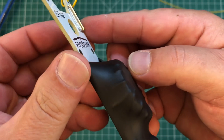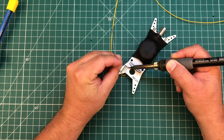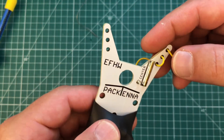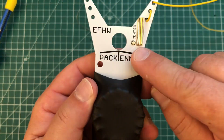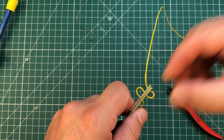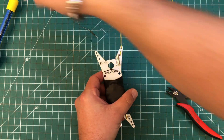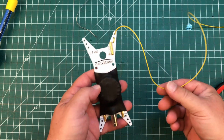So the wire is just barely sticking out. I kind of want to do this as quick as possible so I don't melt the wire. That's about it right there. Good shiny solder there — didn't melt the wire, that's good. Now I'm going to trim off the excess there just to kind of flatten this out a little bit. Let me go ahead and pull the slack through. We'll put some more alcohol on here, clean up any extra residue from the flux. And now we can go outside and cut the 17 meter length.